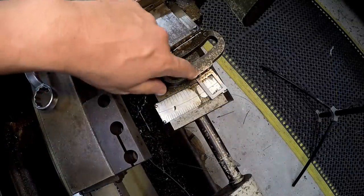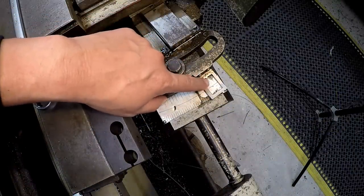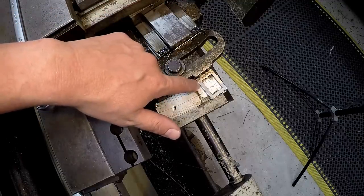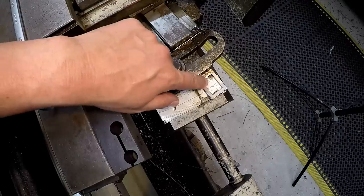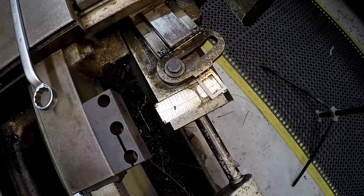I had to go back and move this over. I forgot that I had to double it on this one to go to the eight degree mark instead of the four. So it was four degrees per side, so you've got to put it over on eight. I wasn't getting anywhere near where I needed to be, so now we're getting close.